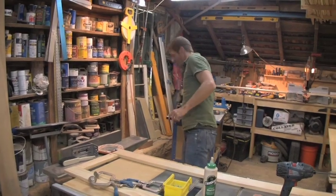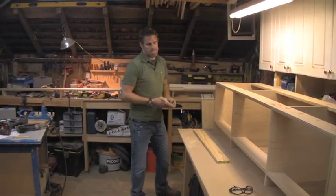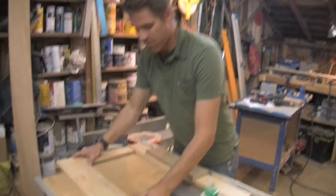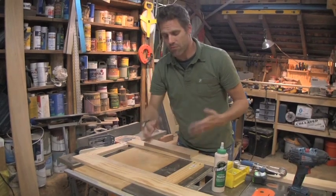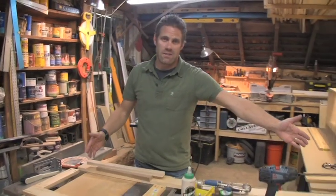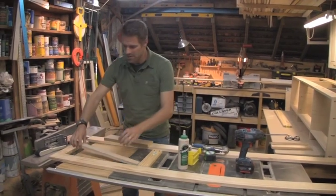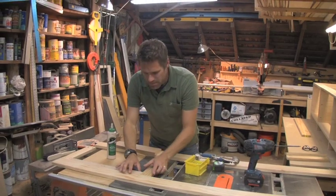Here's a very key point: because I know the distance between the rails, I made a spacer — it's my 19 and three-eighths inch spacer. That drops right in place when I position my next stile. I put a little glue on it, screw it in, and do the same thing at the bottom. This keeps the opening not only square but the exact same dimension all the way across. When I build the drawers, if this opening is off a sixteenth of an inch, that drawer won't fit — so spacers made from scrap wood save you a ton of time.